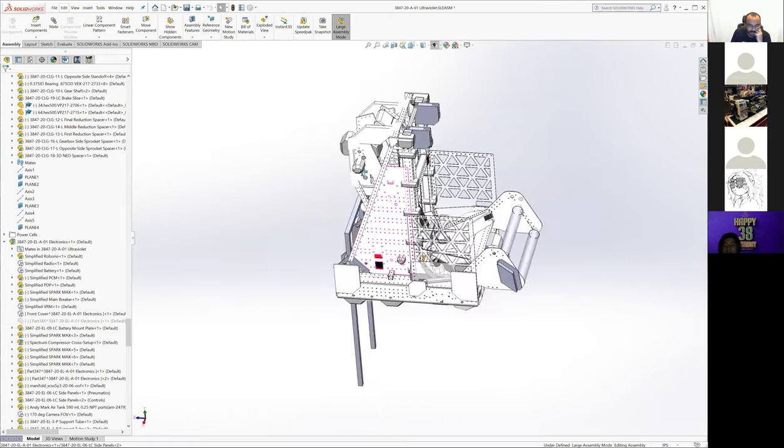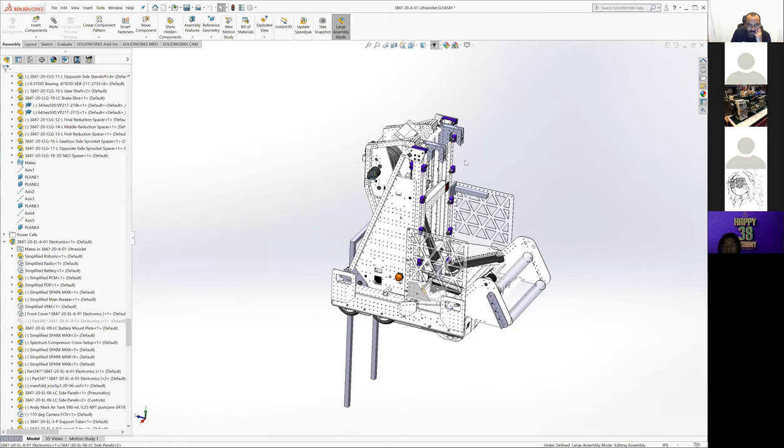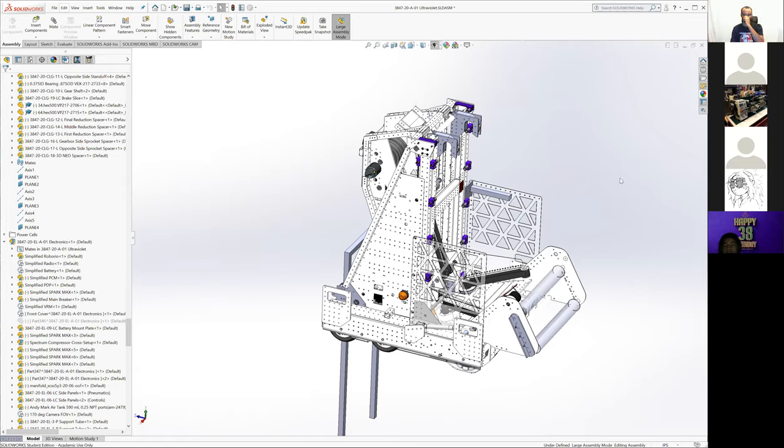Oh yeah, do you want to talk about tall short, Ethan? Sure. So on kickoff day, we had a 30-minute conversation about being tall or short, and we were like, there's not really that much value we see in going short, so we decided to go tall. The main things are the ball exits at a higher point, so with your arc you're more likely to make it into the goal. You have a larger margin of error for both the 2-point goal and that 3-point goal. Shooting from a higher point means your shot is less likely to be blocked, but more importantly, our Limelight was less likely to be blocked. And also there's more space for things in general.